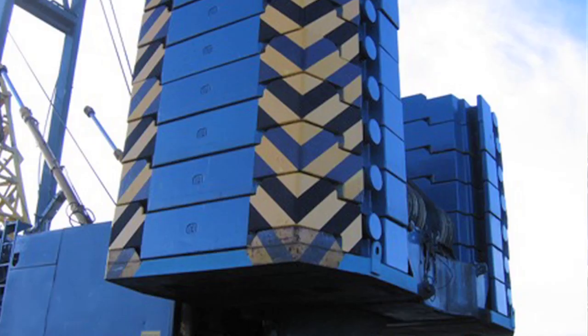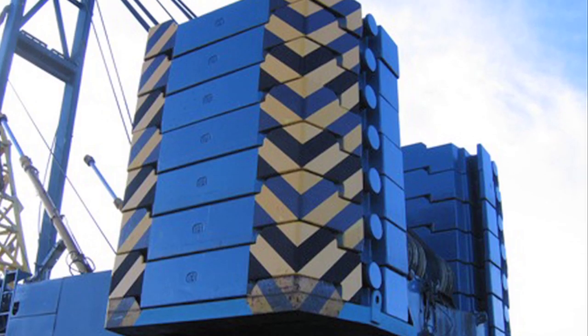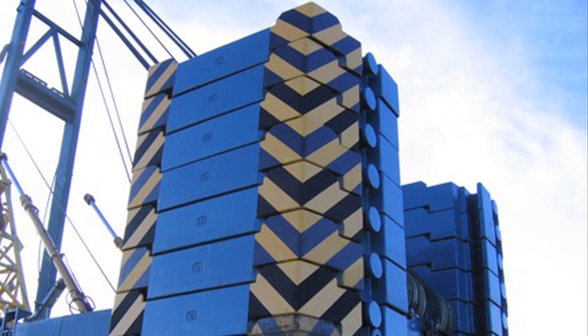Finally, make sure you use the correct amount of counterweights. Too few counterweights can cause a crane to topple. Even a light load can topple a crane if used at a long distance. These accidents usually happen at the end of the day, and even an experienced operator can underestimate the counterweights needed.